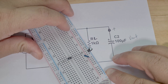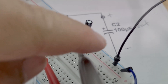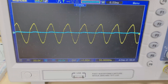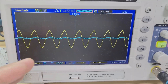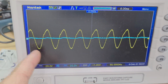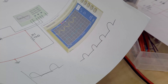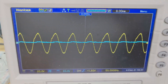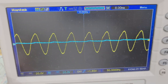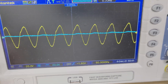I've dropped the 10 microfarad capacitor in parallel across the resistor. Now I'm reading the voltage across the capacitor. If you look at the oscilloscope — the yellow is the input voltage and the blue is the output across the capacitor — you can see that compared to the previous bumpy output we had before, we now have a pretty much straight DC line. It's not perfect, but we now have a DC output that I can feed into a linear regulator.